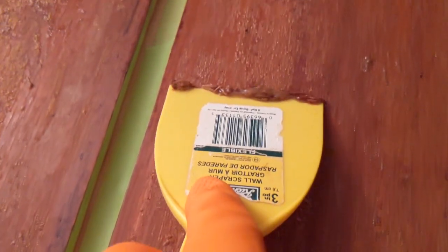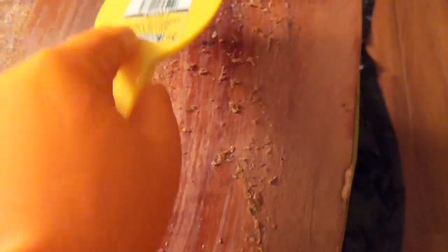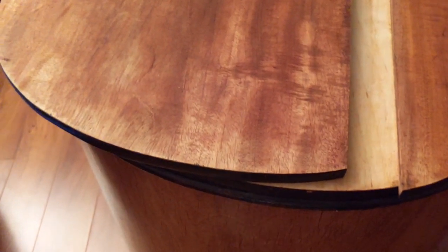I had to do two passes with this, so scraped it all off, and then reapplied everything, and scraped it off again. Then I finally got back to bare wood. To neutralize the stripper, you just wash it off with warm water. Taking off all the layers revealed some pretty nice wood underneath. It also revealed some white putty from some previous repairs. Who knows when that was done.